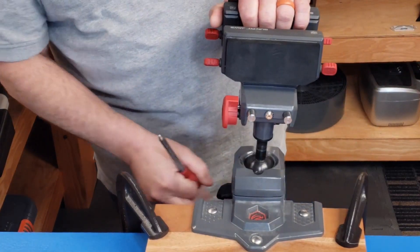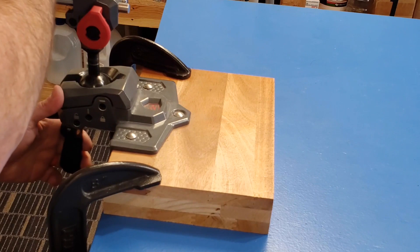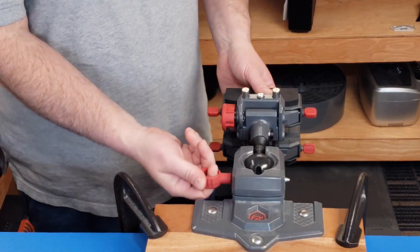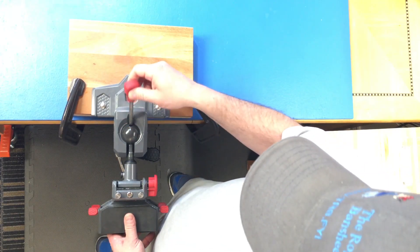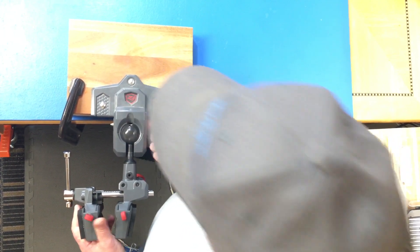You also have this torque pin. What's great about it is you can put it in here and it locks the ball joint. So you're not just relying on the ball. If you're doing something straight up or straight down, you can lock it in and really apply extra torque — like barreling a rifle. If I pull this out and put it onto the other side, I can mount this horizontally. Whether you're doing vertical or horizontal, you can use this torque pin to really lock it in place. On every 90 degrees, I can lock this thing into place.